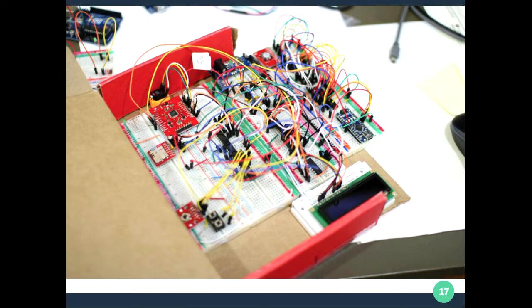Without any spindle changes, you can make PCBs on this machine. Instead of sending Gerbers to China and waiting three or four weeks, if you've got a 3040 with a standard spindle and V-carve bits, you can design something in KiCad or Fritzing in the morning, export the Gerber files, cut it out in the afternoon, solder it, and have the whole project done at the end of the day. Even paying $50 for shipping, you're still ahead with this machine because you can prototype much quicker.